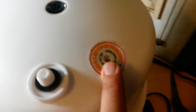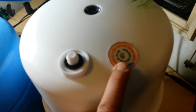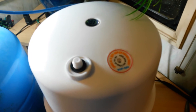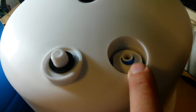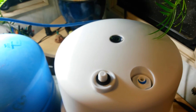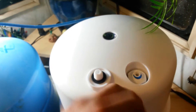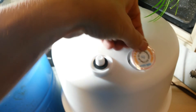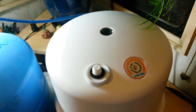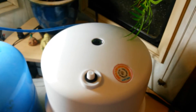This one does have a pressure relief port. If the pressure gets too high it will overflow there, and it also says you can connect that to your drain line. If you pull that up, you'll see it's got a little push-to-connect fitting — you just stick a little hose down there and tee that in with your drain line going from the water filter itself, and they will both drain in the same drain line. But under most situations you can just leave it covered up. Unless you try to put like 200 psi through it, it's not going to ever pop, so you're good to go there.